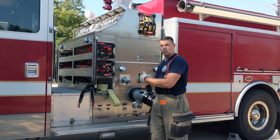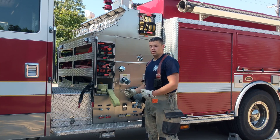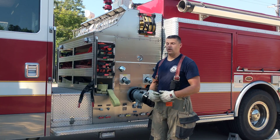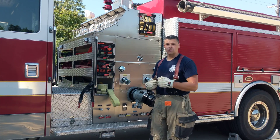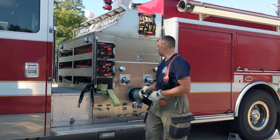When we pull our old hose loads off — our current hose loads that we're using — we end up with a lot of hose mess and spaghetti mess on the ground next to the truck, and we have to use manpower to deploy that. The way this hose load is built, one person can deploy this in probably less than 35 seconds. It's that simple.